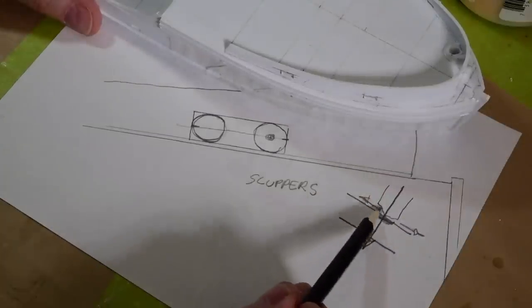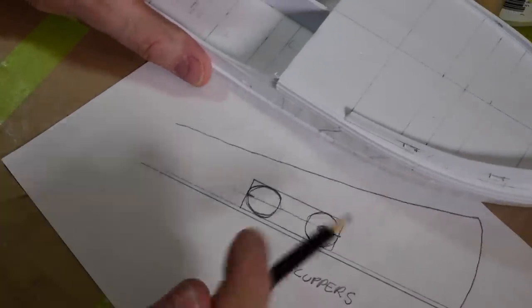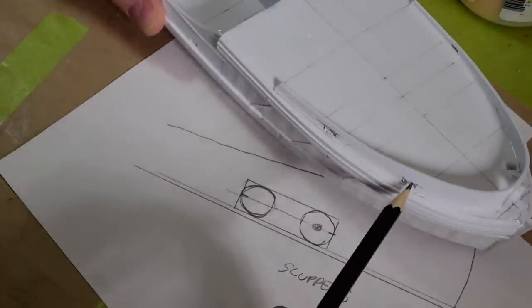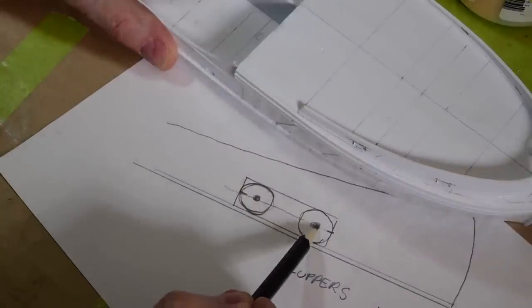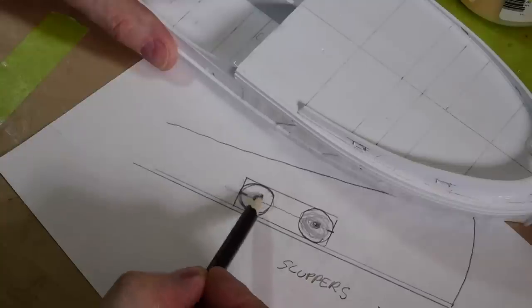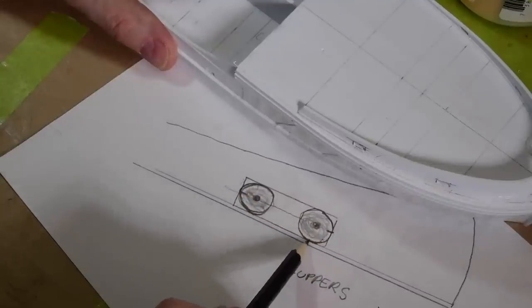If you don't, the drill bit tends to wander and it'll go off center. So then I drill in this rectangle, which is here and here. There's four of them. As I drill the first, like a 1.5, whatever, 1.7, it doesn't really matter. I just graduated up. I think I used three or four drill sizes until you get this hole drilled out, and you got this rounded end like that. It's nice and uniform and symmetrical.